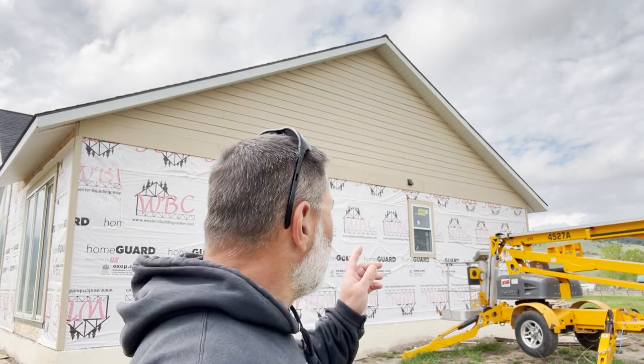There we go. We've got all of the caulking done. All the seams are caulked, and I filled them along the belly board as well, so we have a seamless thing there. When I paint, it'll look really nice. This is going to be probably a little bit different color tan, and then the belly boards and all of the corner trims will be white. And we'll go back and paint all this stuff.